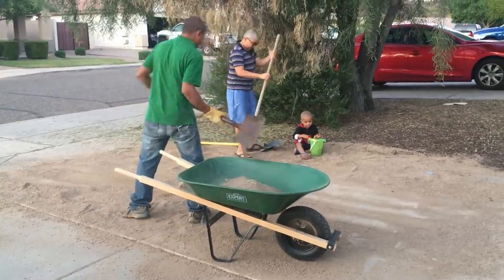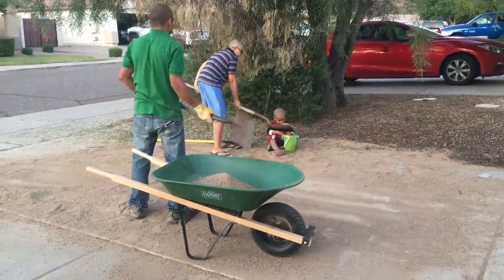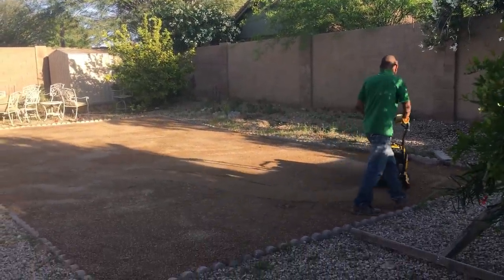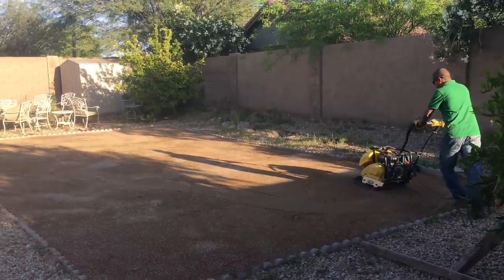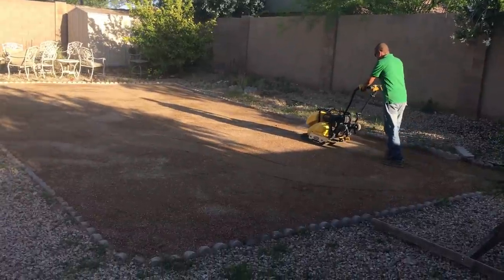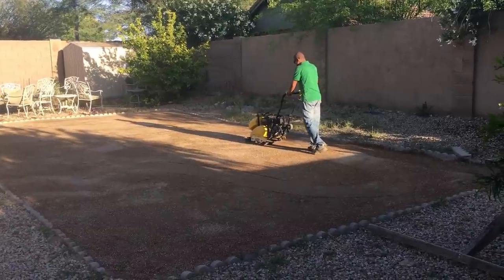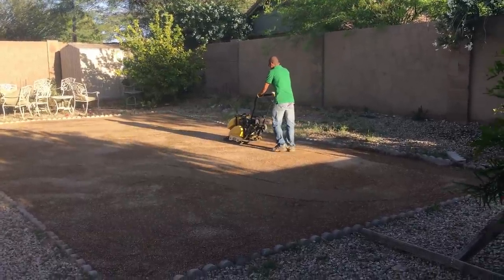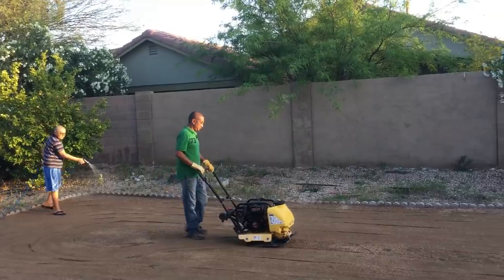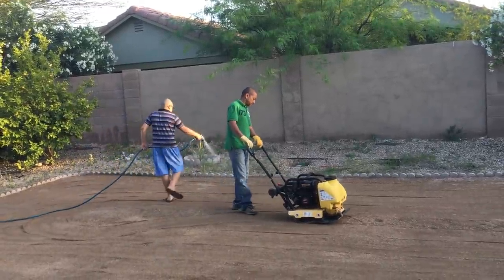This is the last of our rock. The area is leveled, sprayed with water, and compacted. We compacted several times — probably went over it about 20 times at least. We just bought the compactor instead of renting one. I got the job of spraying water.